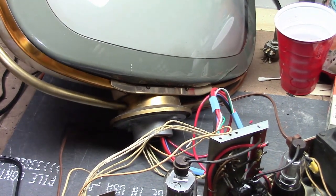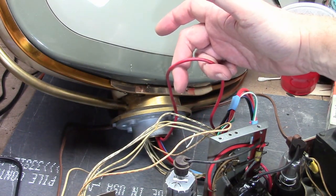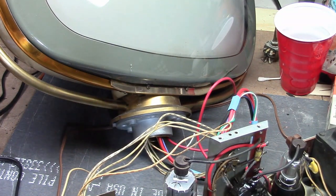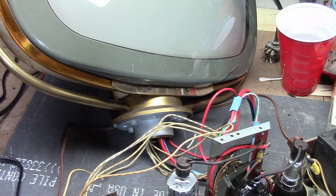The trickiest wires are the ones carrying the higher voltages. There's one going up into the CRT - the wire that carries the high voltage to the anode - and it plugs right into the base of the rectifier tube. That is your anode lead. You want to use something rated for at least 20,000 to 25,000 volts. It has about 16,000 volts on it normally, but it's nice to have some overhead. You can buy it from Belden by the foot, though you'll probably have better luck on eBay or asking around the community, because from a major parts vendor it's going to be quite expensive.